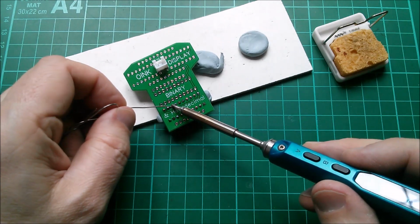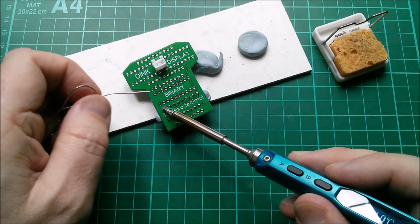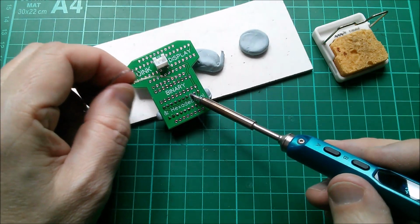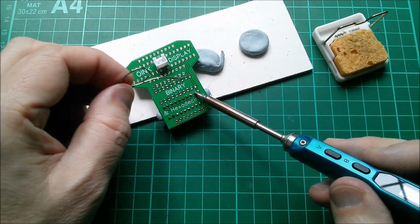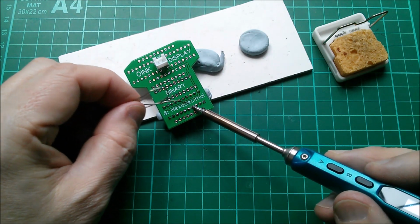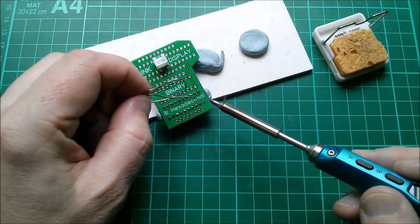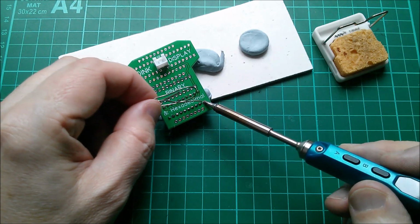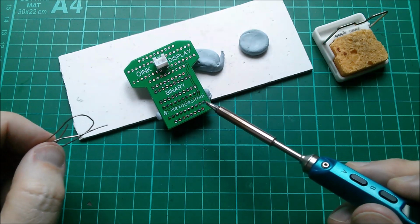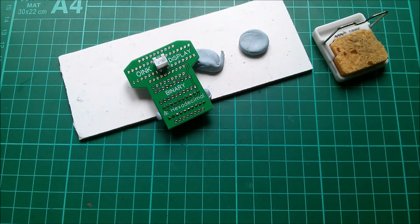So yeah, I would always put the spokes in, and in fact I wish that you could control the thickness of the spokes, because I would happily have gone for thinner spokes, particularly in this design where not much current is being drawn. Well, I suppose it is driving 8 LEDs, but no, it seems you can't adjust the... Oh, this is another ground one. That's right, I think that's pin 1 possibly, which is the output enable, which is permanently pulled low.